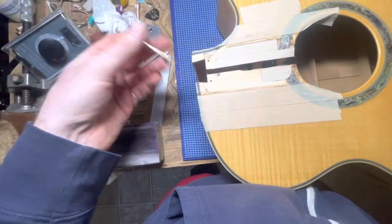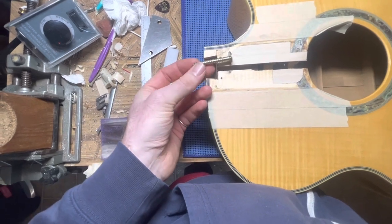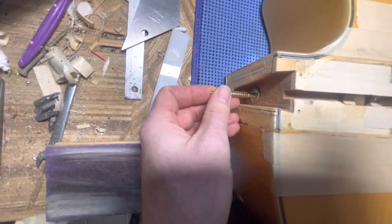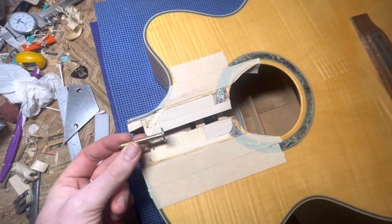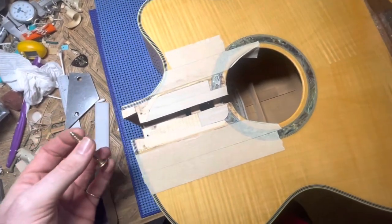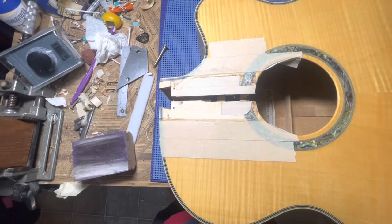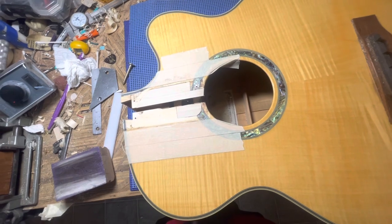In this instance, none of that happened. We're just looking for an incredibly high neck angle. But typically I do add this screw. So you'll see, I'll drill a hole in the head block, mark that onto the dovetail of the neck, drill that into the neck, and that'll help everything out in fitment a lot. So you'll see that, and I'm gonna try a different camera angle, so you're gonna see more of the workbench.